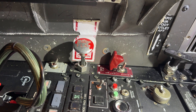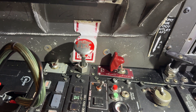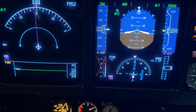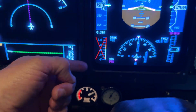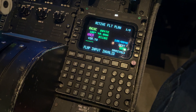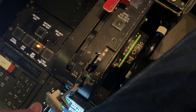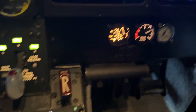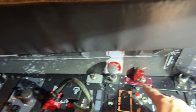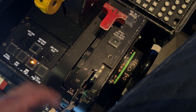Emergency flap cover up. Switch this to emergency. When we do that, the autothrottles will automatically disconnect. You'll also see a red X over the angle of attack. You'll get a message on the FMS: 'Flap input invalid.' Now we can move these flaps to whatever we want, but we will get no movement of the flaps at all — because when you turn this switch on, it takes the flap handle out of the equation.